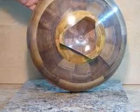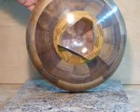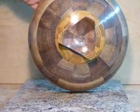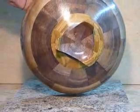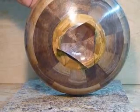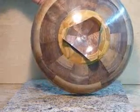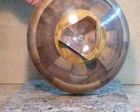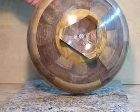so I have a nice three-claw foot. And the way it's attached, the bowl has a mortise cut into the bottom of it, or a recess, and that's actually what I use to chuck it up to turn the inside, just like I normally would. But I wound up using that to my advantage, because on the foot I turned a tenon and then used the tenon to chuck it up and then hollow out what would have been the inside of this small bowl. But of course, after cutting and everything, it became a foot, and that way it assures us that when the two pieces meet up, they're exactly centered, and it gives it a little bit of mechanical strength as well. So that's just glued into place.